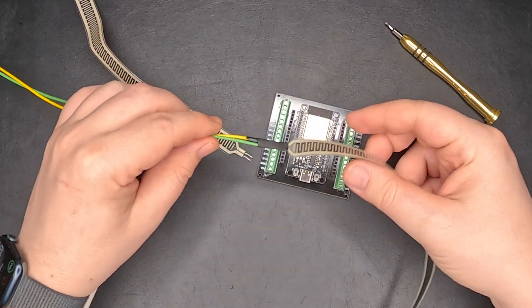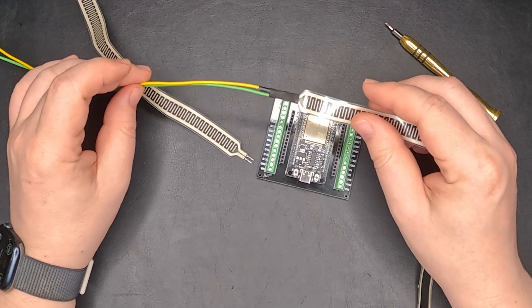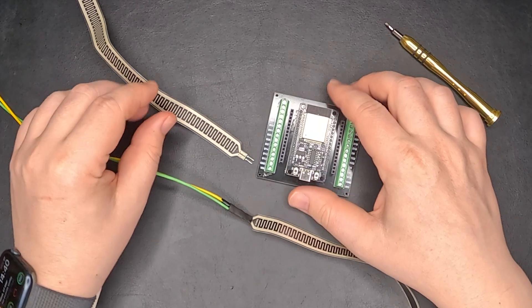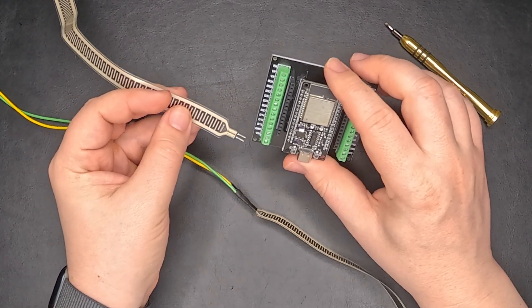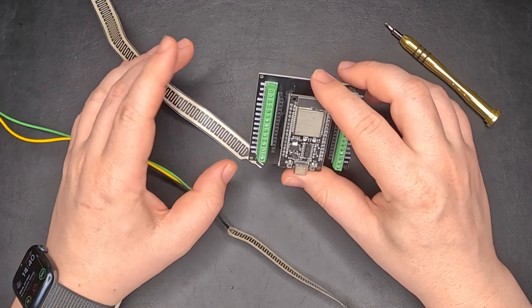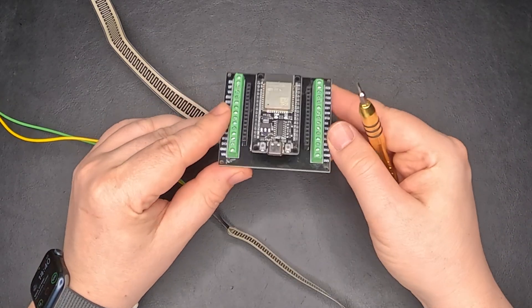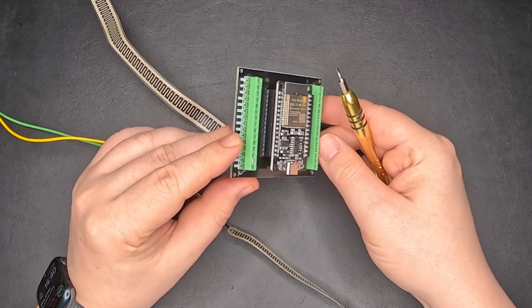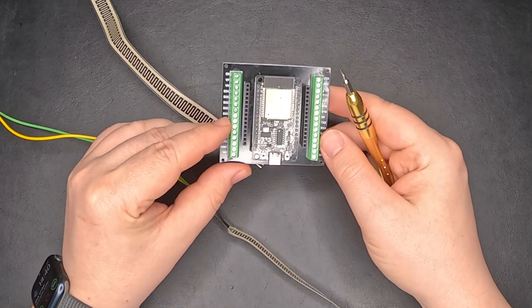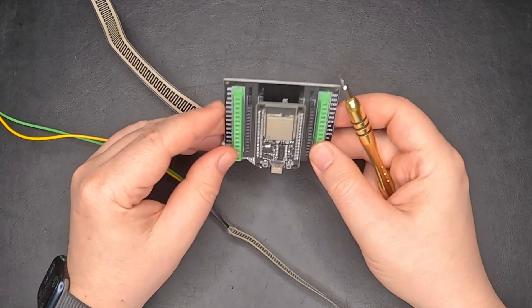I already started with the second band. I only soldered two pieces of wire that would allow me more flexibility on the installment. In this episode we're going to have a look at the simple setup using the ground connection that will give us an occupied or clear status. Of course there is also an advanced option where we can use the 3.3 volt output from the ESP32 with an extra resistor, and there we can actually determine the weight of the person in the bed. I do not need so much detail, so a simple on or off is more than sufficient for me.